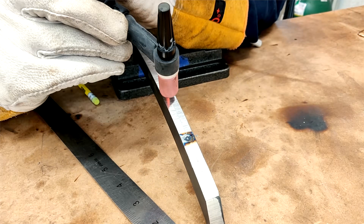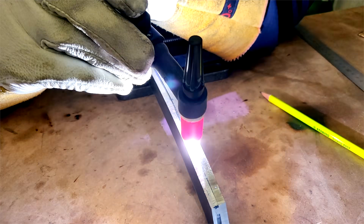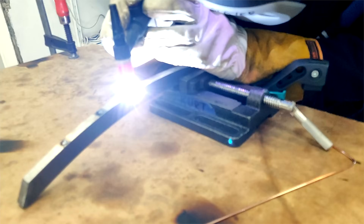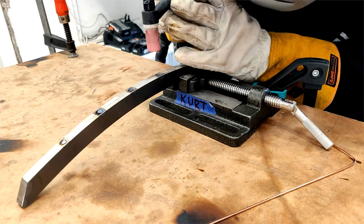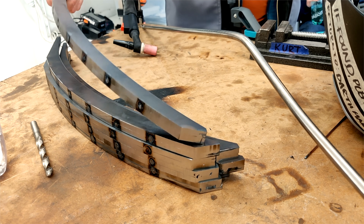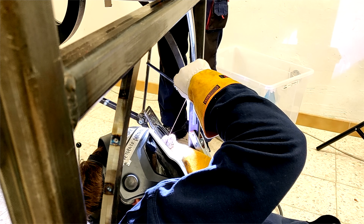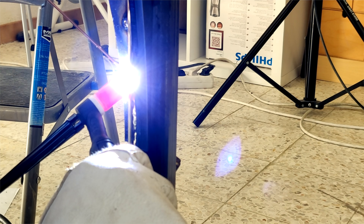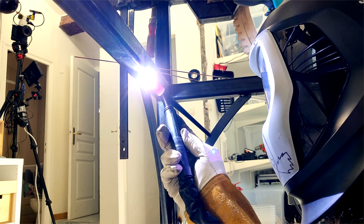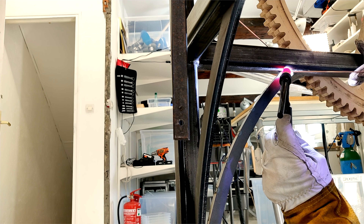We had made a mistake — we had ordered the same part twice. JD cut this part and we also cut this part in Germany. But that kind of turned out to be an advantage, because we realized we could just double up the thickness of this part and put the extra part we had ordered together with JD's part. Marius welded together the extra diagonals and that created a cool look. Since we didn't want to disassemble the whole machine, Marius spent a full day lying on the floor welding upside down — that is tough. He did an awesome job, and the diagonal stiffened up the frame a lot. Really big difference.